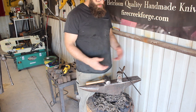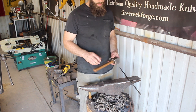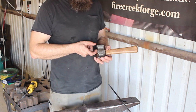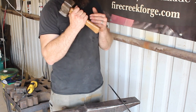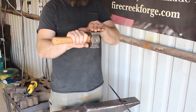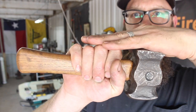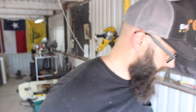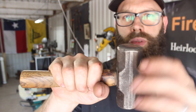One of the design features of the Fire Creek Forge rounding hammer is that the distance between the handle and the face of the hammer is minimized. That means you want to be able to look at your knuckles and have the face of your hammer approximately come into line with those. You can see right here the face of my hammer is very close to the plane of my knuckles — much closer than this other hammer. And again, half an inch or five-eighths of an inch can make a big difference ergonomically.